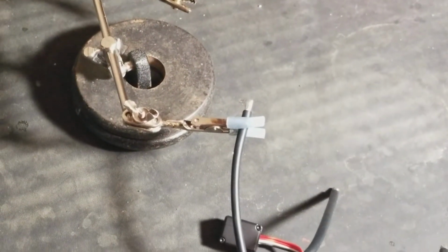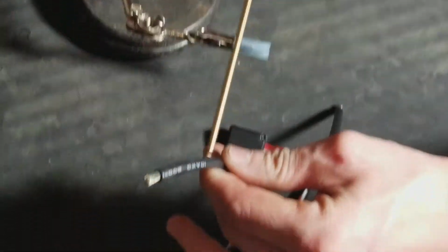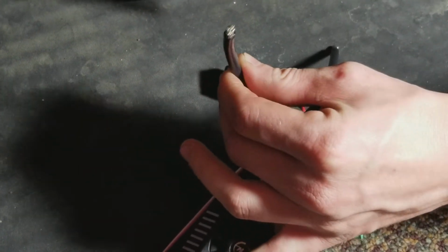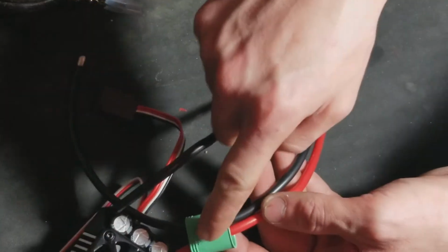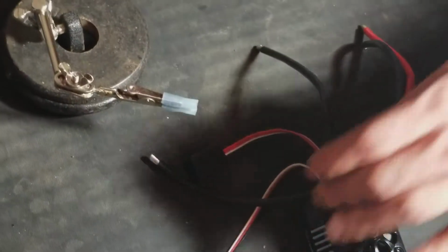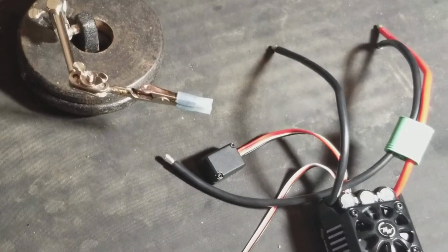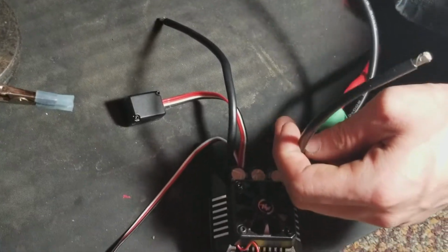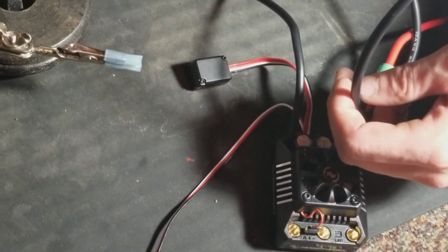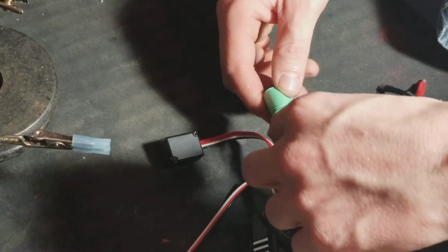Okay. So, you got all your wires pre-tinned here. They're all hot. Make sure they're all pre-tinned nice. They're good. So, basically you got your connector through there. Now, you want to make sure you get the polarities correct. So, this wire that swings over, this wire needs to go to the positive side of your connector. So this needs to go to the positive side. So this will go through the positive side, just like so. Like that. And then obviously this will go through the negative side.